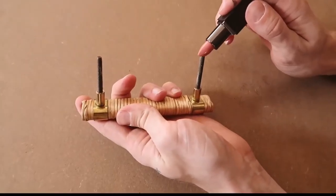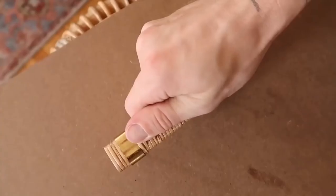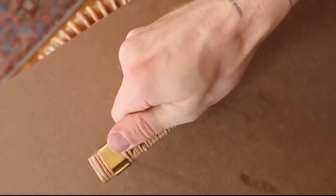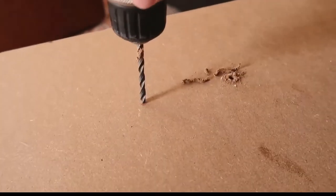The second-to-last hack is for anyone installing new hardware in a kitchen, on furniture, or a bathroom vanity. When hardware has two screw slots it's much harder — they have to be symmetrical and perfectly placed. A great tip is to use lipstick: apply a little onto the screw holes or screws on the back of the handle, then use that lipstick as a stamp to transfer placement from the handle onto the cabinet door or nightstand. You'll have your lipstick spots to use as drill guides, so drill right over the top of those marks and wipe away any excess.